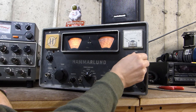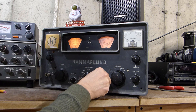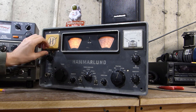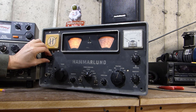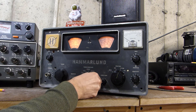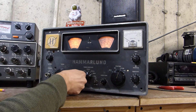I can play with some of the other controls to try and make it sound better. I think there is supposed to be a solar storm coming through tonight so the band may be a little low, and the radio is also old and in need of an alignment so stations are going to be a little weak. The noise limiter doesn't seem to work on sideband, and I know the AVC doesn't work on sideband — that only works on AM. It seems like that switch is a little messed up, but once I activated it things came up a bit.